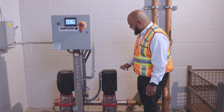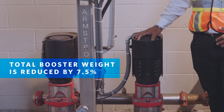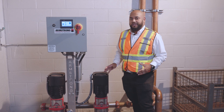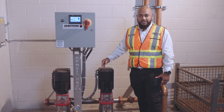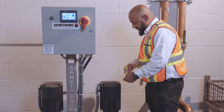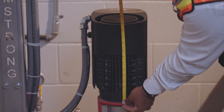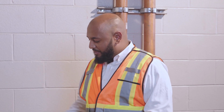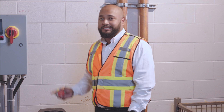In terms of weight and size, these motors are about 50 pounds each — that's about 31 pounds lighter compared to an induction motor plus the VFD that you would have strapped onto it. 50 pounds doesn't seem like a lot, but when you realize it would be much bigger and you're carrying 80 pounds, it adds up — especially across five pumps on a Quintiplex booster. In terms of size, we're looking at about 10.5 inches of depth, 8 inches of width, and about 13 inches of height. Comparing that to an induction motor, that's about 9.5 inches wide, 16.5 inches tall, and 15 inches deep — so a lot deeper and a lot taller.